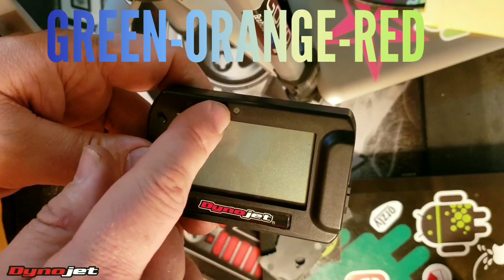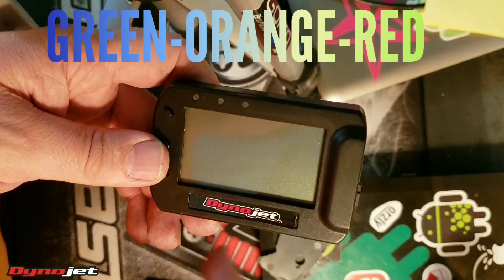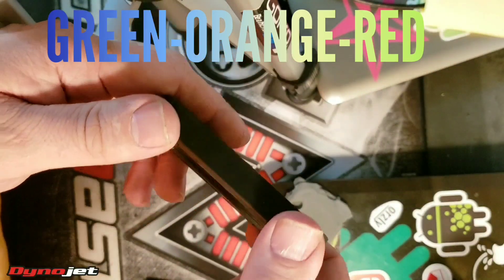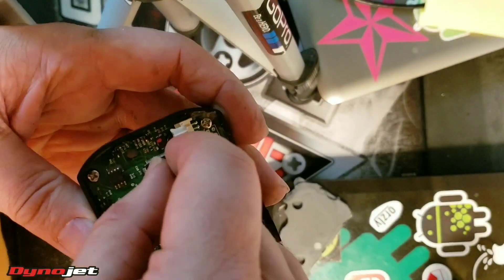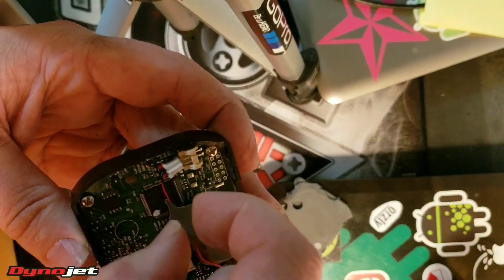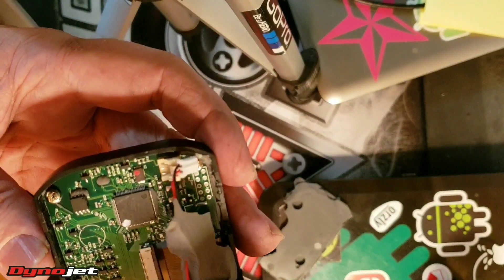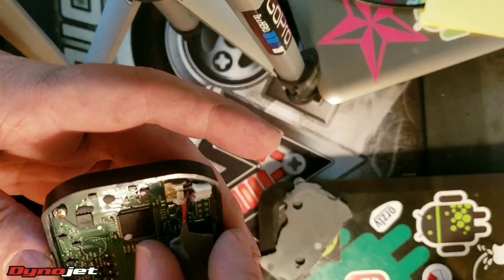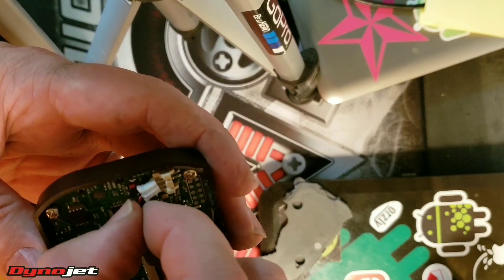You have a yellow, green, red LED in there. I'll give you guys a little status update — I'm going to unscrew these screws. Unfortunately this tab is broken, but I think we can hot glue that back in there. You can see there are just two prongs; we want to be careful not to break the solder at this end.